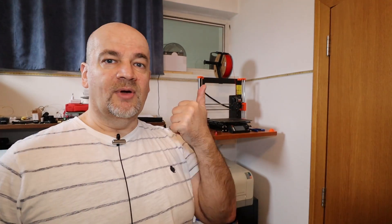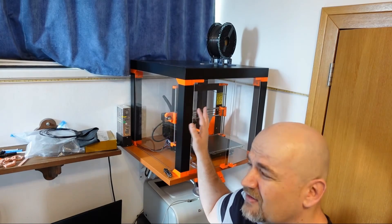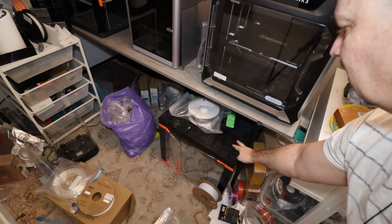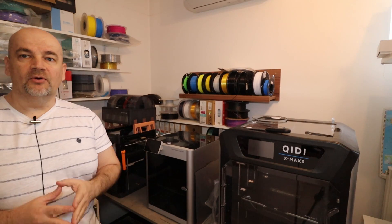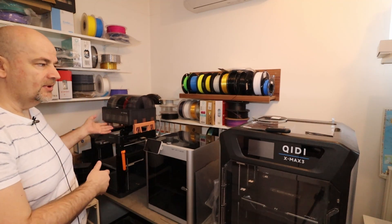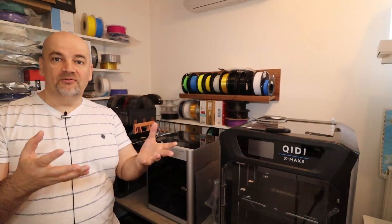Back to my main working room. This is my computer, here I have a 2D printer and a 3D printer. The Prusa Mark III was my first printer and was located here — this is now the Mark IV. Earlier I used the IKEA LACK enclosure but I didn't place it back because I don't really need it anymore. I use the Mark IV only for PLA, PETG, and TPU filaments. These are my main printers currently. This is the Bambulab P1P with the AMS unit and I am using it only for PLA filaments. I already tested this earlier — for PLA materials it is better compared to the X1 Carbon, as it is open so it has better cooling. By default, with stock settings, it has a brass nozzle compared to the harder nozzle on the X1 Carbon, so the layer adhesion is better with the P1P for PLA.